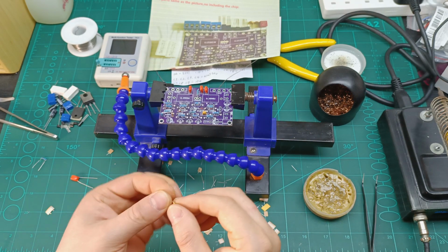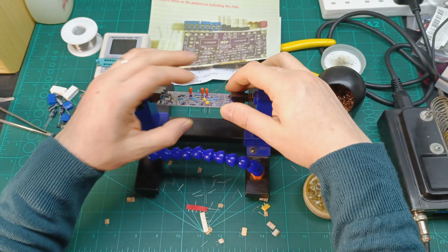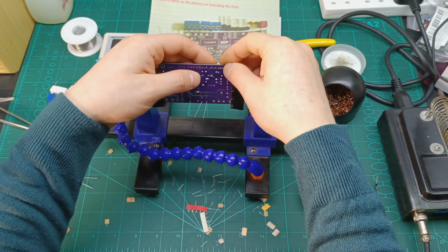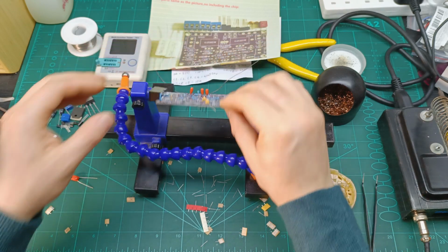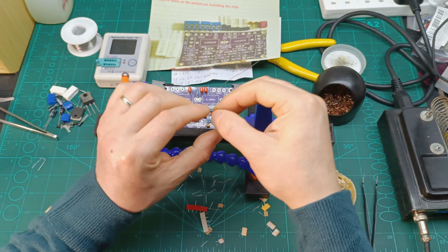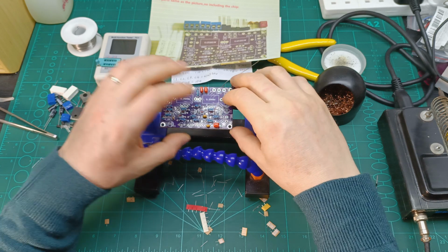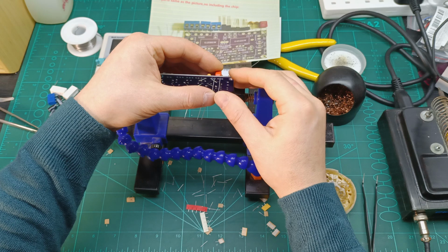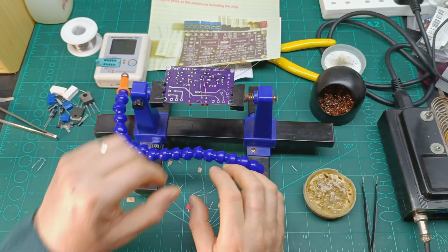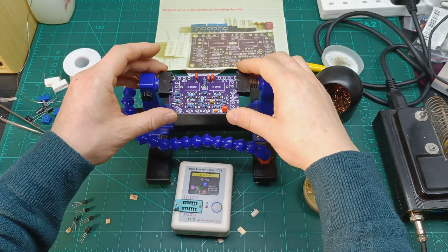and we have another over there, where I say 2 to 1 is C6 over here. Hold on, yeah, it's that one. And the 1 microfarad should be the input, which is this one over here. It goes down there. And now I'm gonna solder them and we're gonna go with other components. So these small capacitors are all in over there, as you can see.